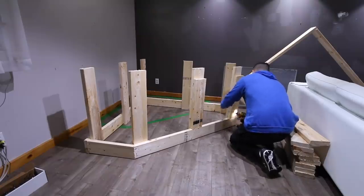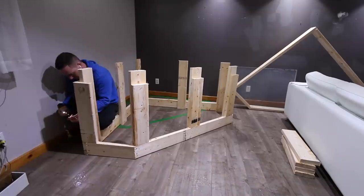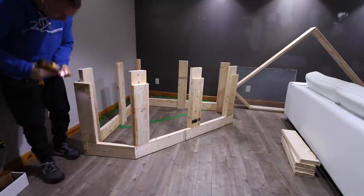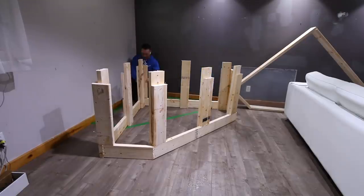Typically I wouldn't brace the center if I was building a glass aquarium, where all the weight's on the perimeter. But with a plywood tank the weight is distributed evenly even in the middle, and we don't want any sagging. The stand ended up being about 34 inches tall. The tank itself is going to be 30 inches tall, and there's a window right by the stand — I didn't want the aquarium to block that window at all. The overall height is going to be about 64 inches, which I think is ideal. I still have about a foot of space above, since these dropped ceilings are only seven feet tall.